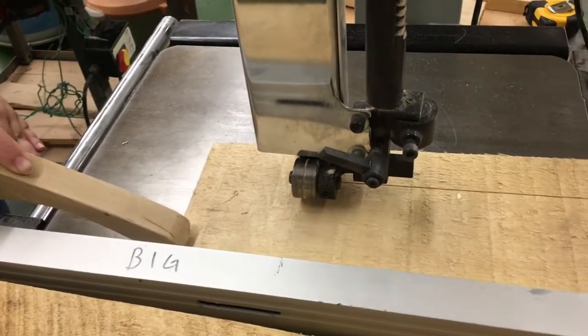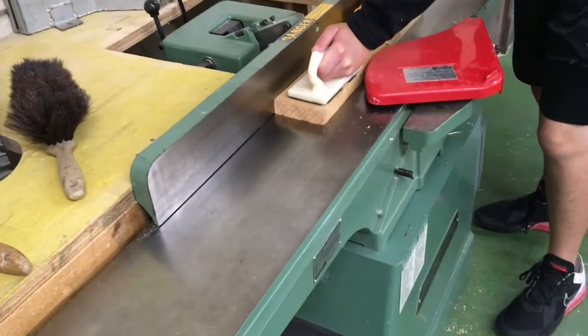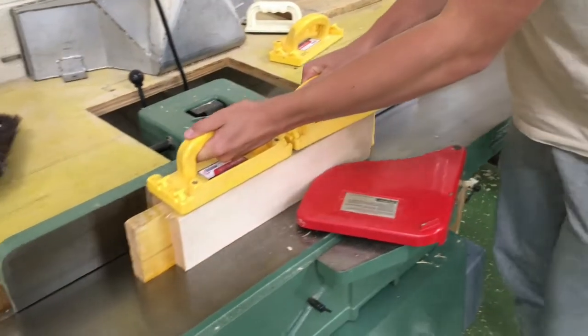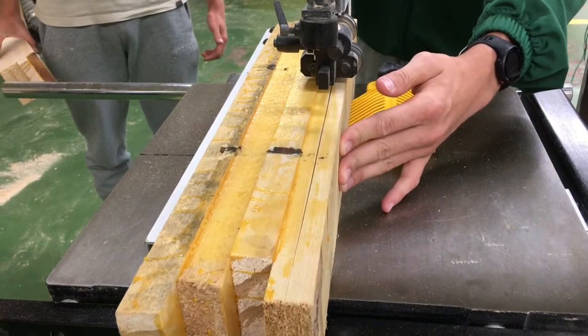With that first project, we're using basswood for this activity. I received from my kiln facility that we buy lumber from a bunch of cutoffs. They're kiln dried sections of basswood, and prior to gluing them up, we put them on this big bandsaw here, and we cut them down to about 4-inch strips. And then we head over to the jointer, where we joint faces that need to get glued together, glue them, clamp them, head back over to the jointer another day of course. We join them, square them up, and then we've been resawing them to our usable blanks. I believe we're cutting down to about 3.5 inches square, and that allows us to get that square piece to turn on the lathe.